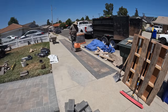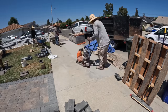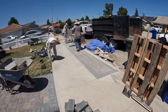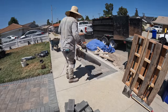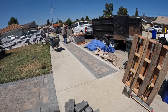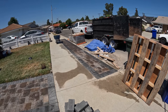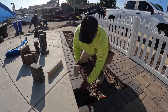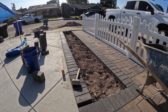We did do the city sidewalk area as well. I just didn't get a whole lot of film footage for this side, but it was much better than how it was previously. The person that did this area previously — when they tried sealing it the surface was wet, and it basically turned the whole surface a milky white color. That's why you really need professionals when sealing, or it could ruin your pavers.